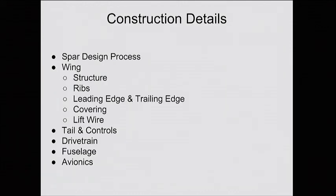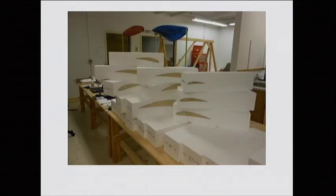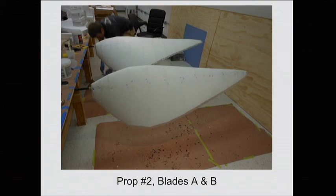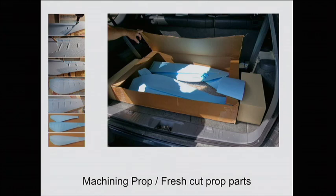I'm going to go over construction details really quickly. First thing we did was build tables — it's really important to have big tables to build these wings on. Then we built some propeller blades: first a 10-foot diameter, then we went up to a 12-foot diameter to get a couple efficiency points better. We hot-wire cut these out. We realized these were too heavy because they had a really big chord — about 750 grams each, when we wanted the whole prop to weigh about one kilogram. So we changed the design rotational speed of the prop and came up with something much narrower. We even went to the level of machining little pockets in the thick part to save about 50 grams per blade.